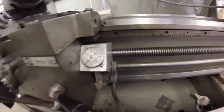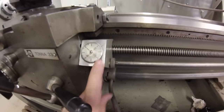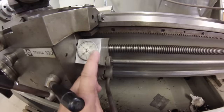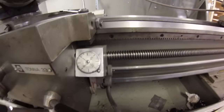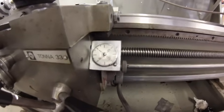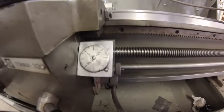If you're running an odd pitch thread, you can use a numbered line only. If you're using an even pitch thread, you can use any of them, but beware that the nut will engage on the half. So if you miss your line when you go for it, that's not going to be very pretty. You're going to have what's called a half thread, and you're going to turn a 10-pitch thread into a 20-pitch thread, and it's going to look pretty ugly.